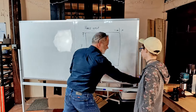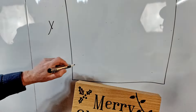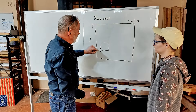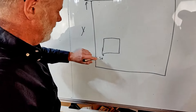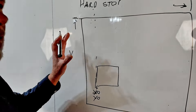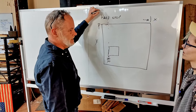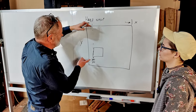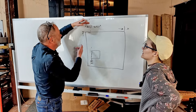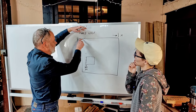There's a start point for a project — like this Merry Christmas block. That little corner there is our zero point, our X zero, Y zero. Let's say you're moving the machine back, back, back just to get it out of your way. It hits the hard stop, but the computer is still counting those steps. Now it's not physically moving but it thinks it is, and it thinks it's moved to 50 inches when it's got a limit of 30 inches.